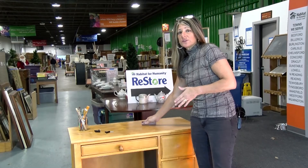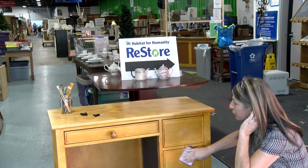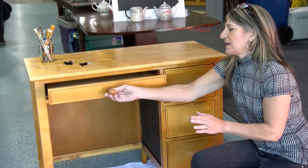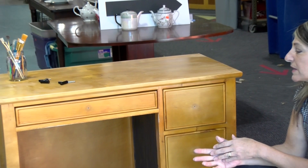If you're selecting a piece to dry brush, I would suggest not selecting something with a high gloss finish because you'll be sanding forever. You just want to lightly rough up all of your surfaces, which I've already done. Prior to that, I've taken off the hardware — this is the original hardware, but I find it a little dated, so I've replaced it with something I purchased.